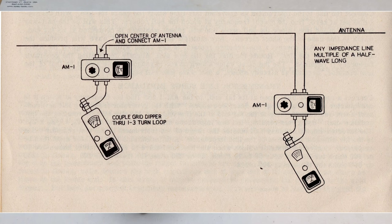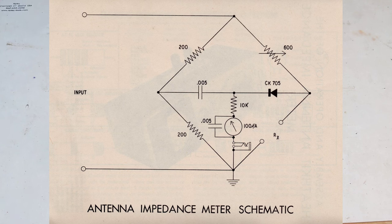The 0 to 600 ohm range covers many common types of antennas used for amateur radio. The primary uses for the unit are: measuring antenna impedance at a given frequency, finding an antenna's resonant frequency, estimating standing wave ratio or SWR, measuring a radio receiver's input impedance, monitoring radio transmissions if amplitude modulated, and acting as a field strength meter.